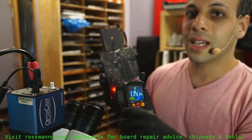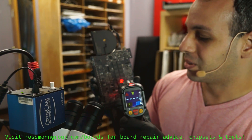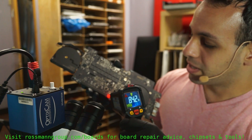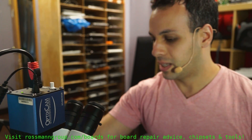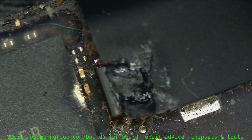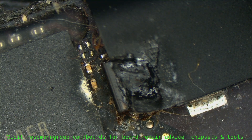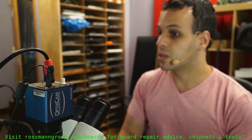This is not exactly the best. It kind of works, but it kind of works messed up. Obviously my short circuit is this thing burning the plastic over here — that's obvious, that is a shorted capacitor. The meter does show it: when I point it at the short it will say that's where my short is. Board is at 90, move up to 113, 115, and as I move down it says 135.